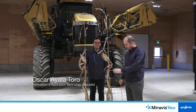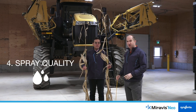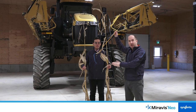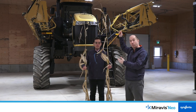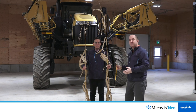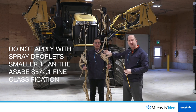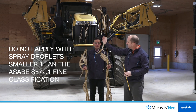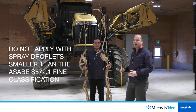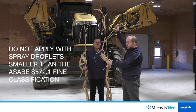Oscar is holding two different corn plants — row spacing is not too bad. Let's talk about spray quality. If you have a coarse or ultra coarse spray quality, droplets are going to travel in a very straight line for quite a long time. In a dense canopy like corn, where we may need to be three feet or more below the top of the crop in order to hit the cob, we actually need to go to a finer spray quality. That finer spray quality allows movement within the crop and some randomness in droplet movement because of air currents, and that randomness is going to help us get down deeper into the canopy and around some of those leaves. We'll also hit the leaves on the way, of course, but this is a measure of using the finest air inducted spray you're comfortable with on your farm to drive penetration deep into the corn crop.